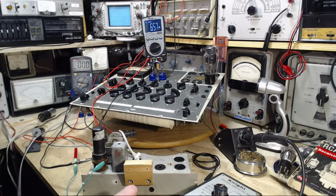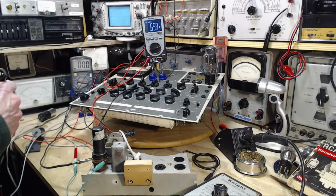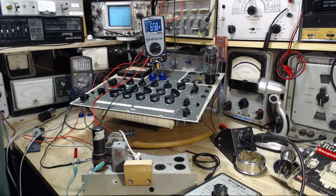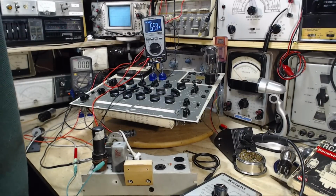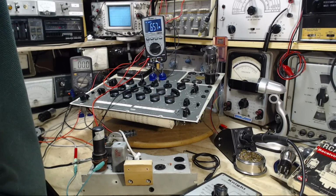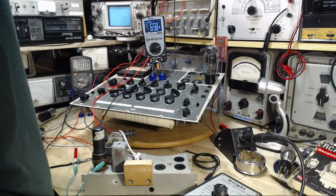Okay, C minus cutoff, the cutoff deal. Let's try that. I'll just lower it here. So we're seeing if this will trigger current. Lowering, it's dangerous to say lowering. I'm going to make the grid more positive. Less negative, I should say that. Less negative. Look at that. It was in cutoff.